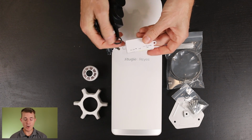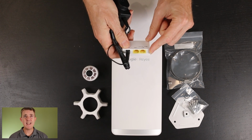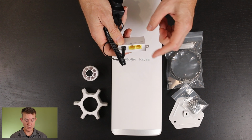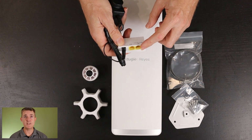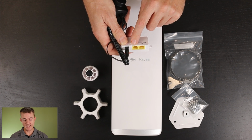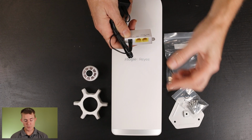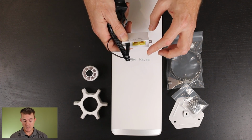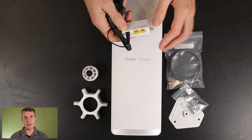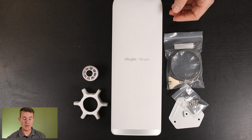We are going to get our PoE injector. So our mains power will plug into this side. Our connection to our router or a network switch that's connected out ultimately to the internet will come into here, which is going to bring our data. And then in this cable connector here, we're going to put an Ethernet cable. That's going to have a mix of power from here and data from here, and that could be now up to 100 meters away from the power source, and that's where this is going to be then mounted on the outside wall. So PoE injector for 24 volts is the first way of being able to power this device,